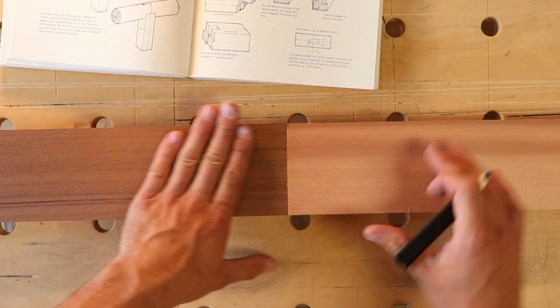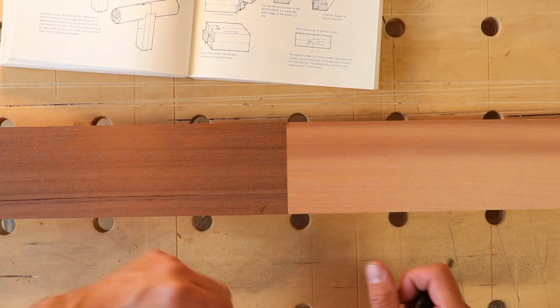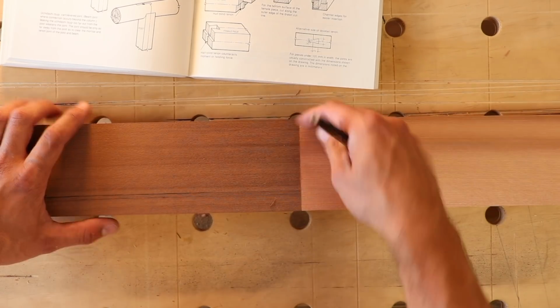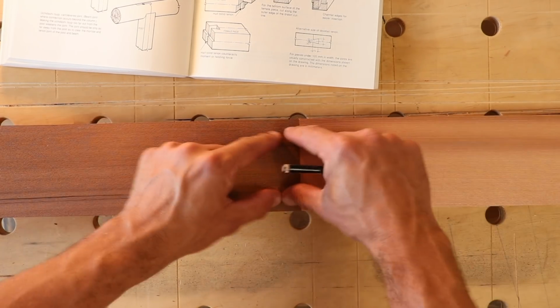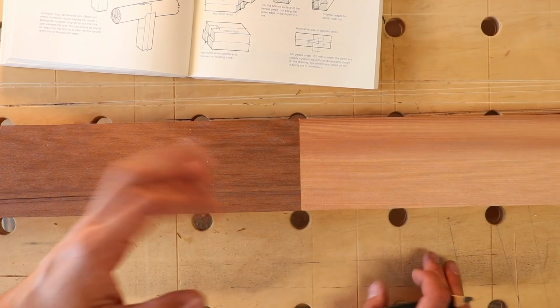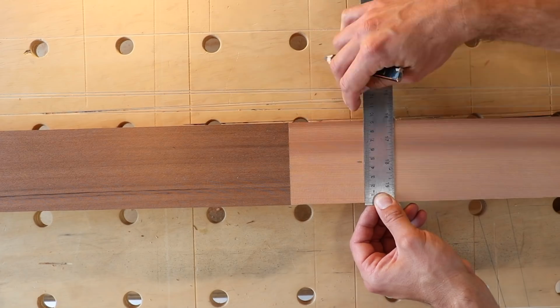This is like what they would use for a bottom plate on a wall frame or a top plate. So nowadays we put nails like that, and then we put a nail-on plate over the top and hammer that down. That keeps it together, and it's a lot quicker than what I'm about to do.